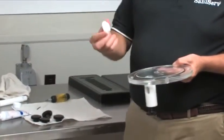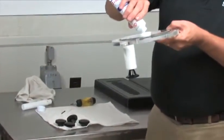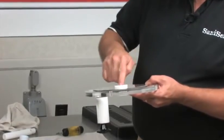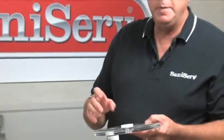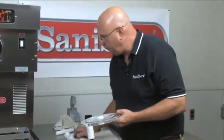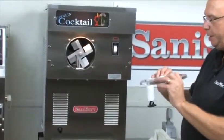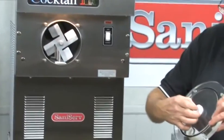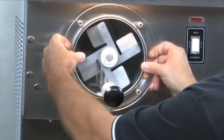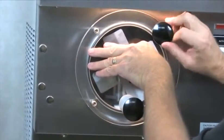Next, I'm going to get the bushing for the dasher and insert it into its hole. A little bit of lubricant on the top and just a little bit on the side — we don't want any on the opposite side, as it's just going to make it harder to get out later. I'm going to get my knobs close by. I'm going to hold onto this O-ring while getting close because it tends to jump out of the way. Pull this out just a little bit, find the dasher first, then put the front plate on to where I can just barely start one knob.